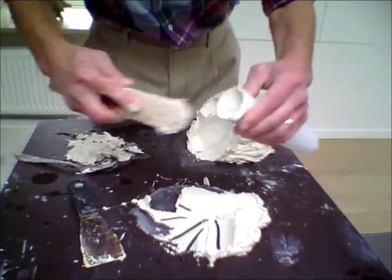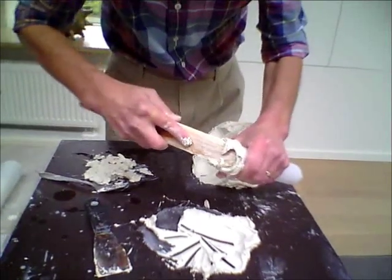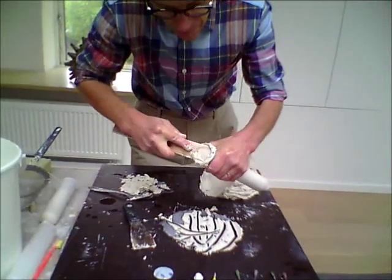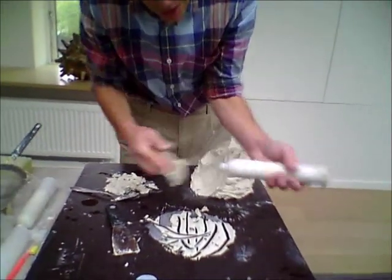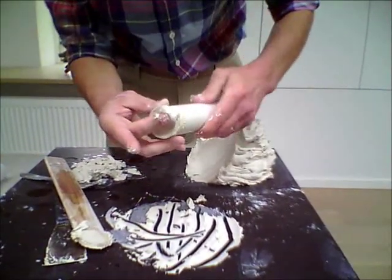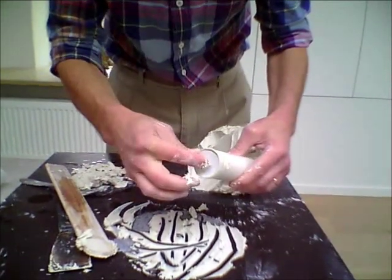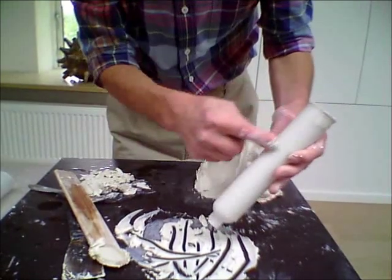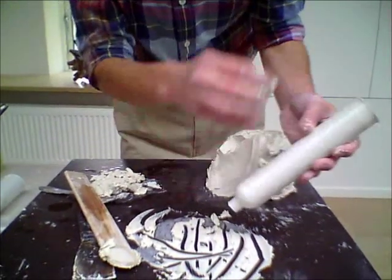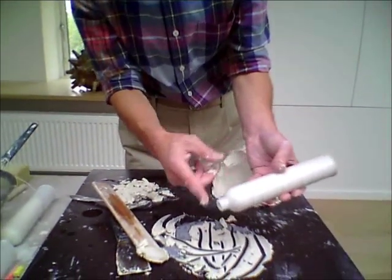You can see it starts filling quite quickly, and it takes a bit more pressure as it goes down. It's nearly coming out the bottom — then just take off any excess and we've got a little plastic plate that goes in the top. The air pressure is now going to press that down, slowly extruding the clay. From about 2cm down, if you don't have a plastic plate the air just pushes through, and since this will take about an hour to print, after an hour of printing you don't want the air pressure to blow over your print.